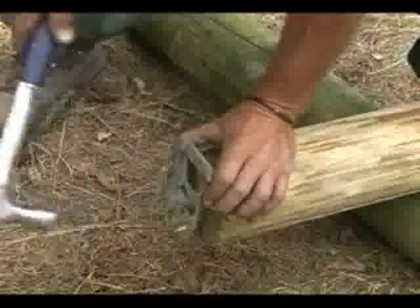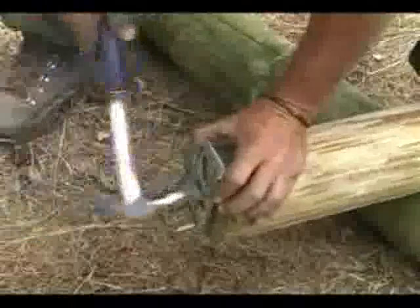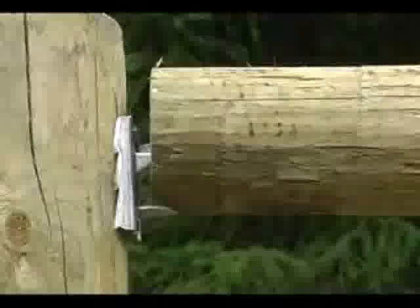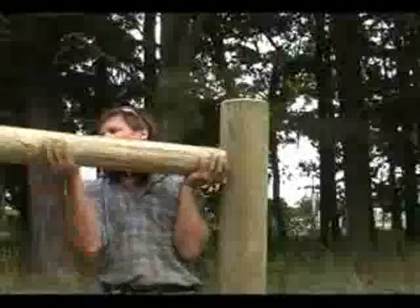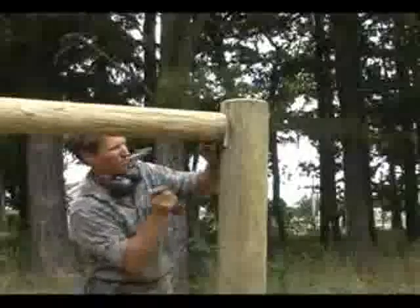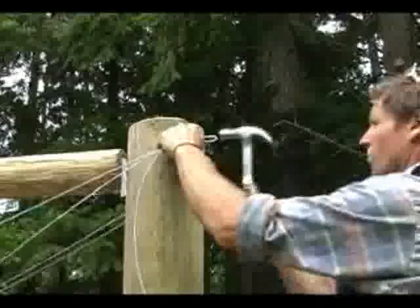Another ViceBite bracket is adjusted to suit and secured to one end of the horizontal stay — two sharp teeth are designed to secure it in place. The opposite end of the stay is lifted into place on the first bracket, then the other end of the stay lifted up on the inside of the backing post and secured into position. Three or four wire loops are then fitted to complete the assembly.